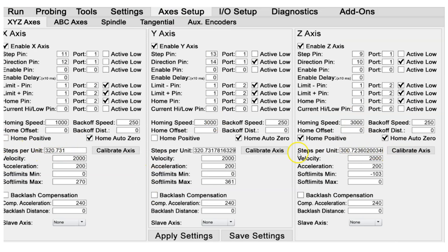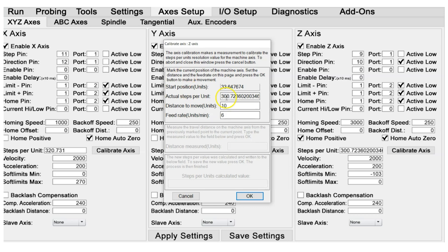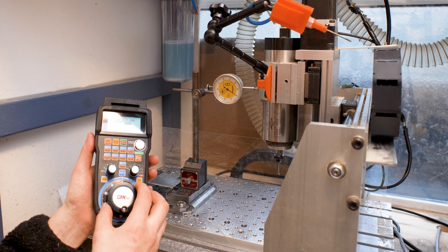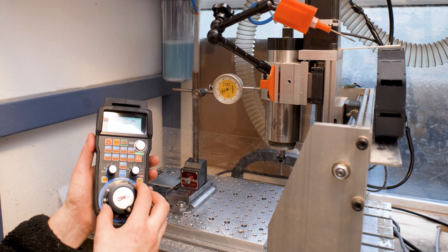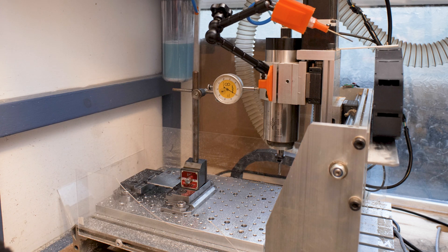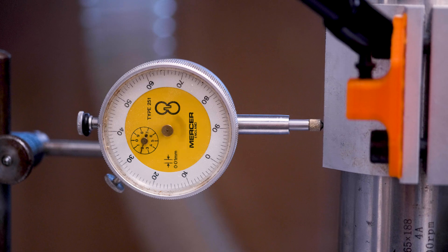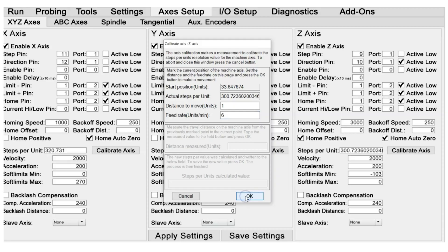To calibrate your axes, you go to the axis setup and then go to Calibrate Axis. I've already set these up so you can see the values, but I'll show you what I did. When the dialog pops up, the two boxes will be blank. You need to enter the distance you want to move and the feed rate. I've got a dial indicator set up on my axes — it's a plunge one with about 10mm of travel. I set the movement to say 1 or 2 millimetres; feed rate doesn't really matter, you can keep it at 6 units. You click OK, it moves that distance, then asks what your actual measured value was. You put in your measured distance, it calculates the compensation, you click Save, and your axes are now calibrated.